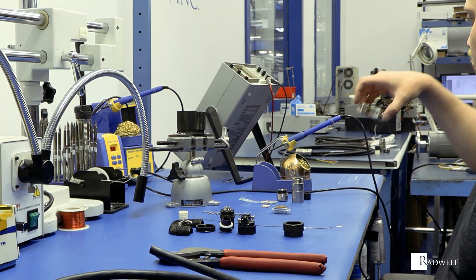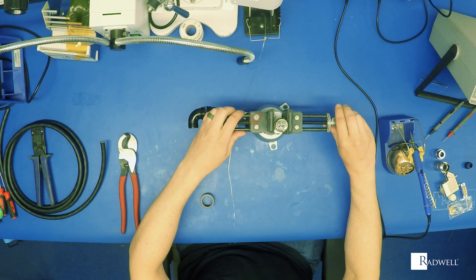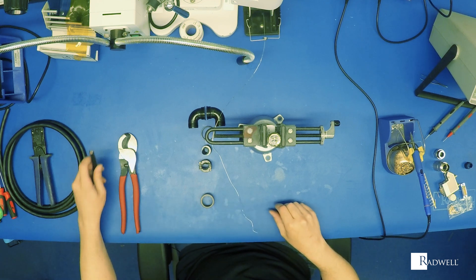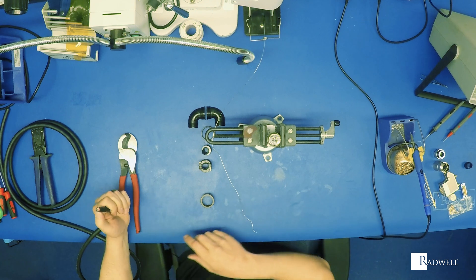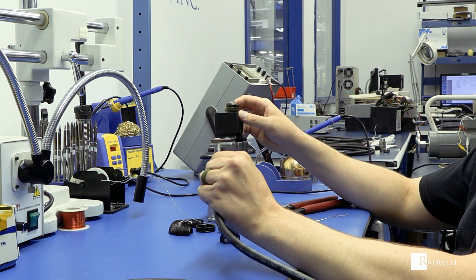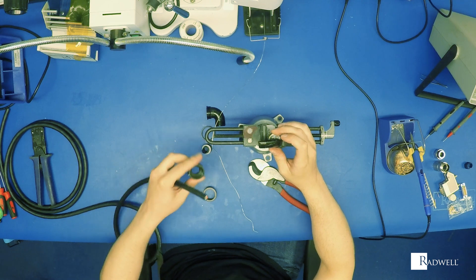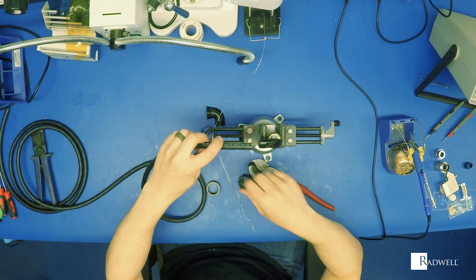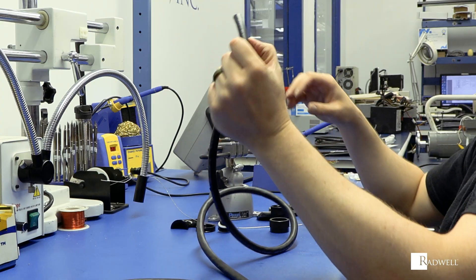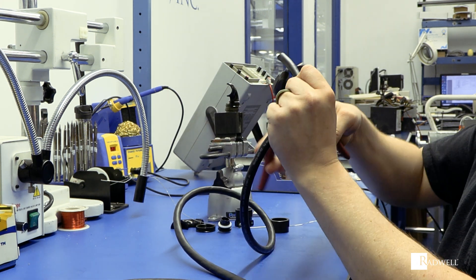To begin, we're going to start with the power cable. The first thing I like to do is mount the connector inside a table vise to keep it nice and still when you're doing your soldering. The next thing is to find the correct cable and gauge for what you're going to be using this on. Before you start, you want to figure out how far back to strip it. I semi-assemble the connector to determine how much to strip so that the strain relief will actually grab the cable.